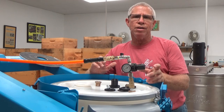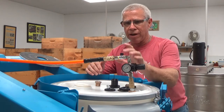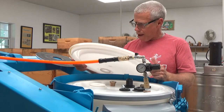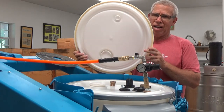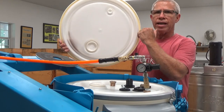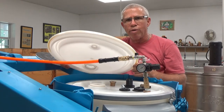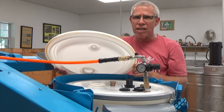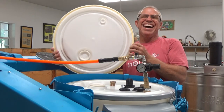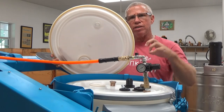Being it's low pressure, you have to be able to deal with the loss of pressure and having a constant flow in it. Part of the problem of figuring out how to do that was coming up with the right configuration for a regulator. The first problem I ran into was with the lid itself. On these lids, on the inside where the lid meets the drum, there is a seal that goes all the way around it. I was working on the assumption that that seal would be enough to hold pressure in the drum, but it isn't.